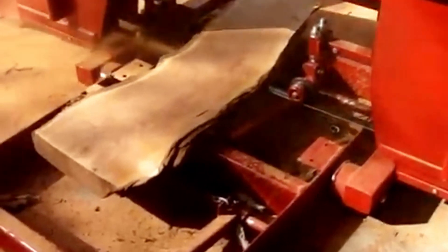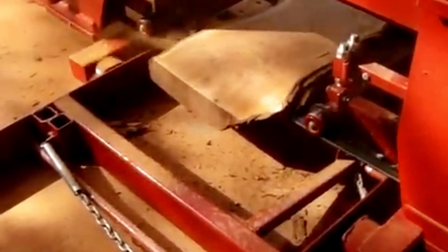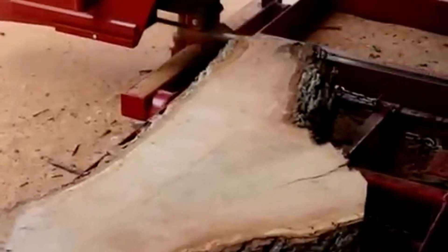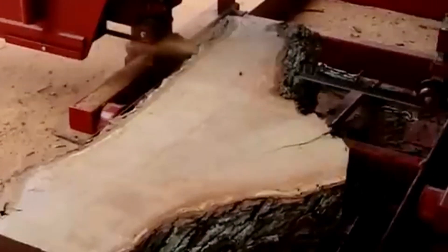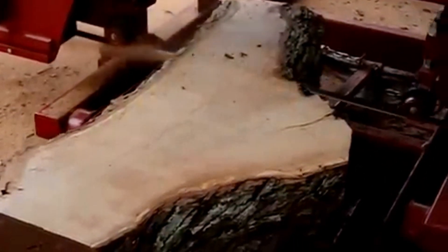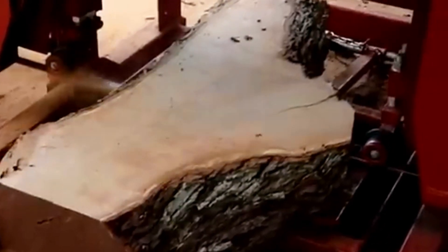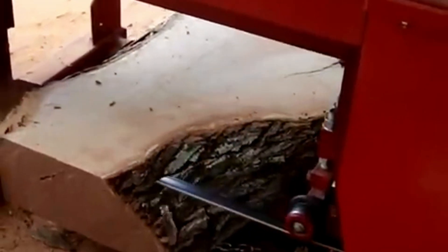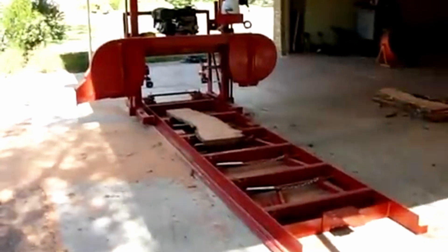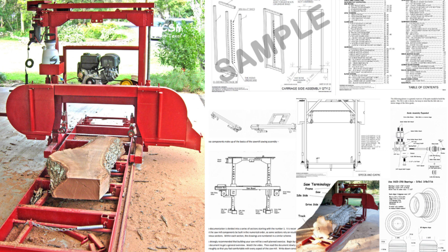Now you've seen a video of my mesquite cutting sawmill version two. This one is much stronger than my original one, much more accurate, and it's not a difficult saw to build. You need a metal cutting band saw — the 64 and a half inch horizontal band saw — a good welder and a drill press, and it can easily be made. I used a lot of fancy things here by embedding the bearings, but you could easily use pillow blocks and flange bearings to substitute for those, and it would just leave a small amount of machine shop work requiring a metal lathe and you could build this. I plan to have plans available shortly on eBay that cover the details, which are just too numerous to cover in a short video like this. I hope you can build one and enjoy it as much as I've enjoyed building this one — and boy, it works good.